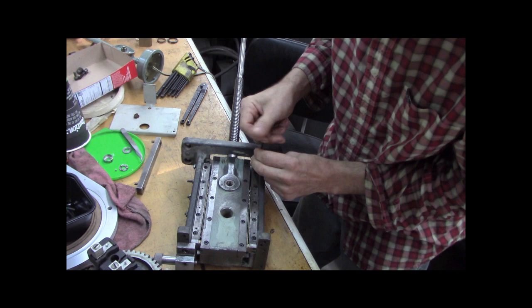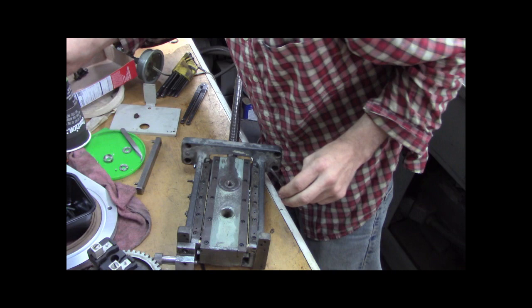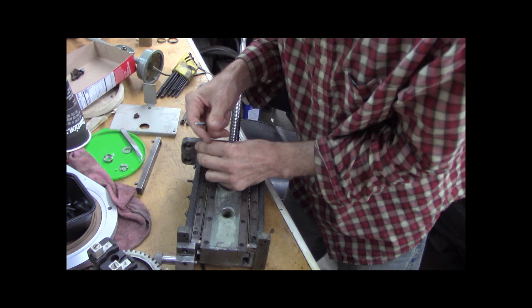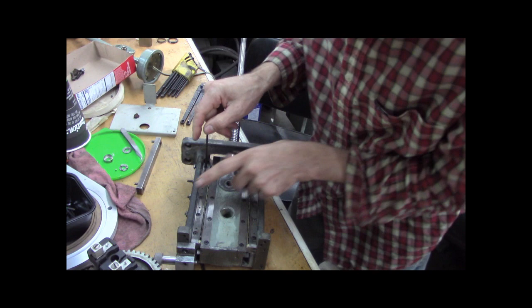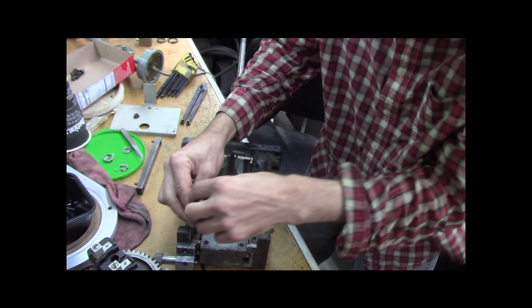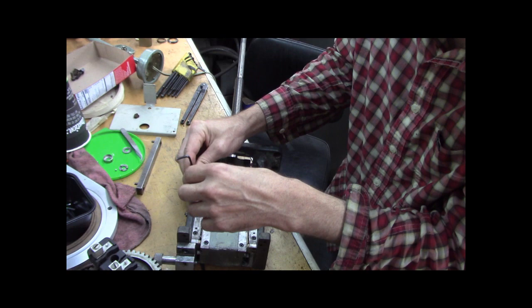And I am just stoked that I got this on here without dropping balls all over creation, which is rather nice. Now I hope these felts take a set. Actually, let's see. Because there's Gibbs, the adjusting screws on this side, you got to kind of just leave these barely snug, adjust them, and then final tighten them. And I guess they're barely snug.